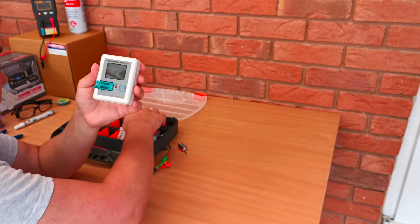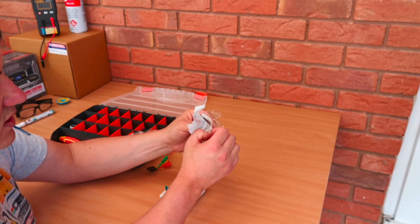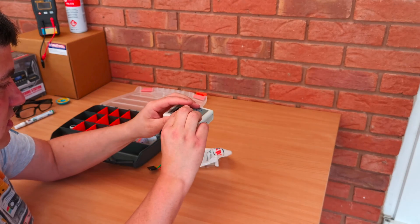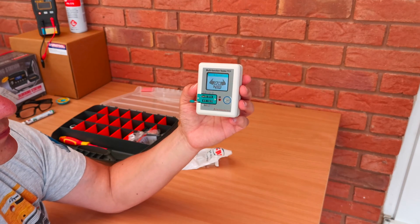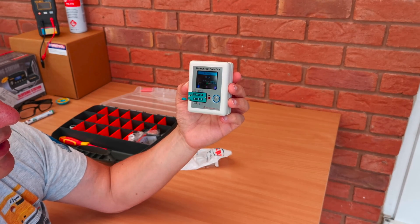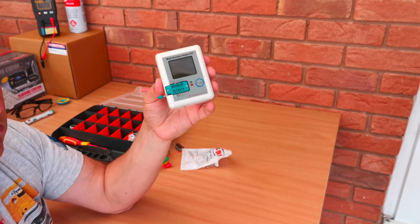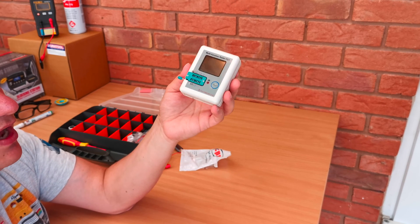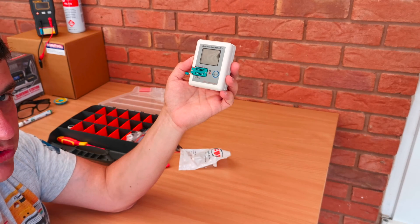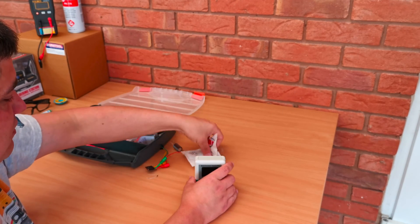Let's see if we've got any resistors in here. What I've got are diodes — these are brand new so there's not going to be anything wrong with them, but we're going to check them anyway. Just go across between pin one and pin three. Lock it in place and this should come up as a diode. Yeah, it measures as a 729 millivolt diode, across between pins one and three. It's really accurate — I wouldn't say it compares to a multimeter and expect it to be exactly spot on, but it's accurate enough to tell you roughly where the component ballpark is, and whether the component is working or way off spec.